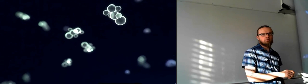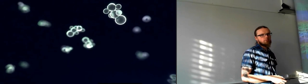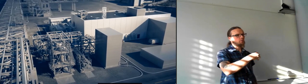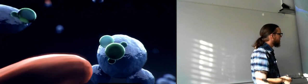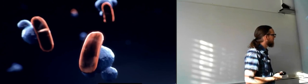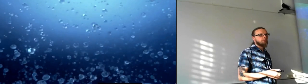But safety-wise, it's a lot better to have it spread like this, because if something happens in one part of the plant, you can manage to shut down stuff and avoid having follow-on accidents happening further on. It's a bit more difficult when you're on a rig where everything is so close together. If you have a valve that explodes or something, there you can quickly damage some other equipment that will again damage more equipment, and then you have sort of a chain reaction going on.